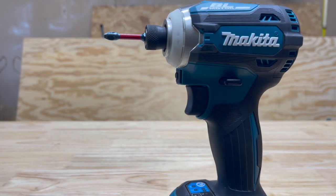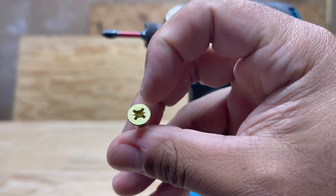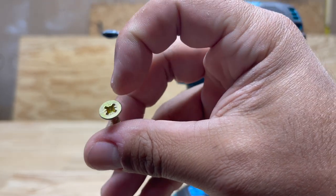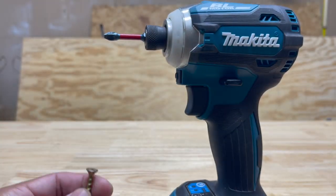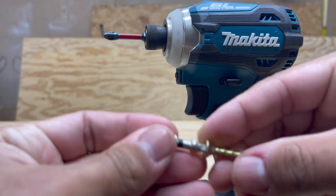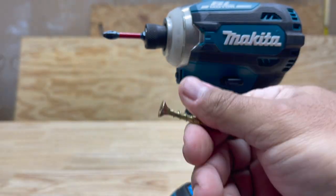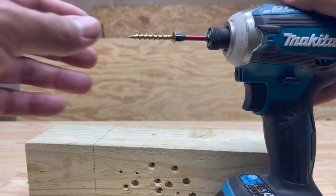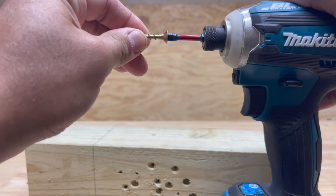Like Posi drive, this bit looks like a Phillips but has little notches. However, with Posi drive you get one notch at each location, whereas with the Phillips Square Drive you have two notches on opposing sides and one notch on each other side. The cool thing about this drive type is these screws can actually be driven not only by the PSD bit, but also by a square drive and a standard Phillips drive. The PSD bit with the anti-cam-out ribs holds really, really well to the screw.